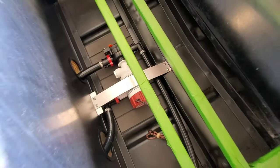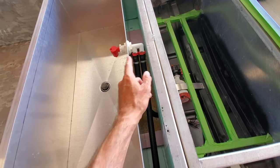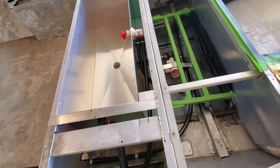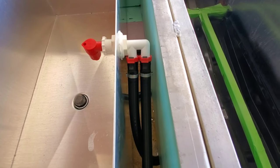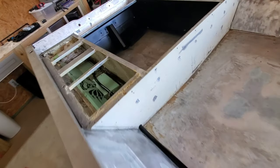The problem I ran into was: if I put the pump in the back with the Flow Right Premium Kit, it's got to pump the water through the hose to the livewell. If you want to recirculate, it's got to come out of the bottom and go all the way back to the pump, then recirculate back — so it's a lot of hose distance and routing. I decided to mount the pump up front, so you've got a short run through and a short run out the side. You've just got one long run from the back of the boat to the pump.